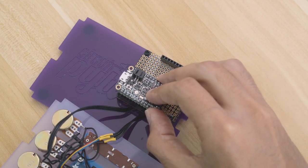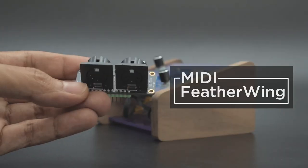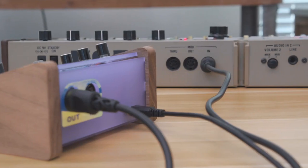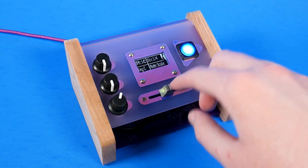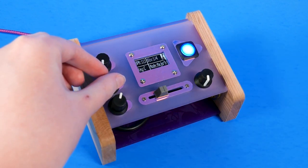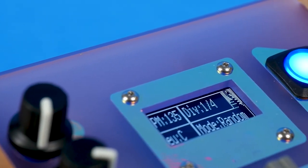An Adafruit M4 Express is doing the hard work here, but we need to take a moment to mention the Adafruit MIDI Featherwing. Instead of using MIDI over USB, this allows you to send MIDI signals over a 5-pin DIN cable, so you can connect it directly to music hardware like keyboards for their note libraries. The slider controls the tempo of the sequence, while potentiometers control the key, note progression, note length, and modulation. There's also a small OLED screen to give you feedback on the current playback settings.